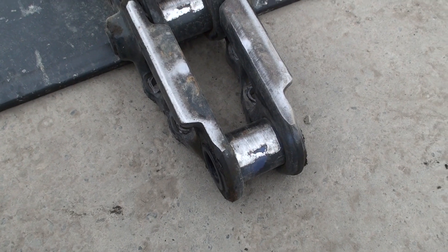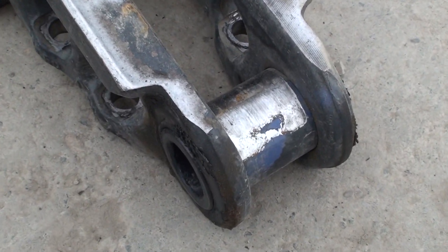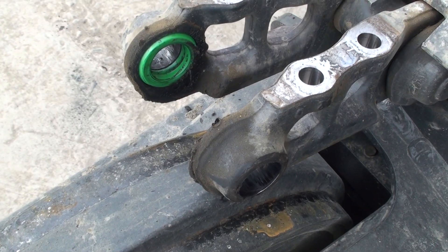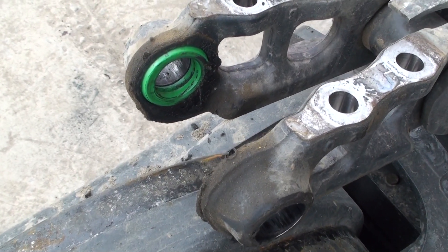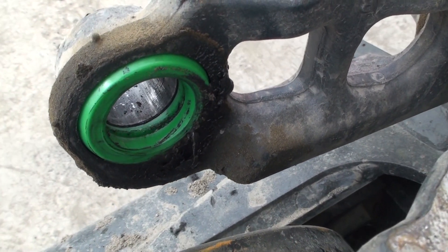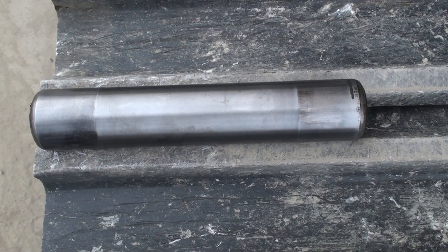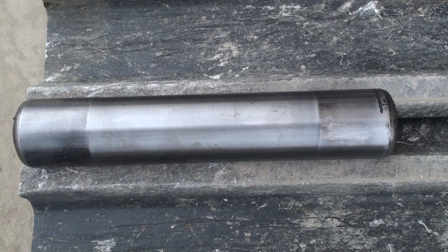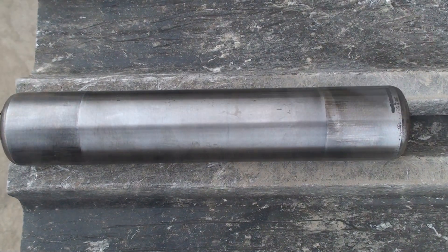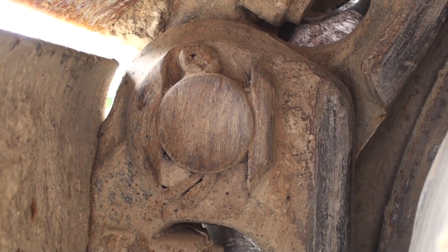The chains are joined together at the ends to form a circle. That joint is done through the use of a master bushing and a master pin. This brand of chain uses a fiber seal on the master pin joint, but most other brands have the spring washers and a metal spacer. Master pins like this are pressed in and have a smaller diameter in the middle to make installing them easier. There are also slip fit master pins with a T-shaped head that are held in with a cotter key.